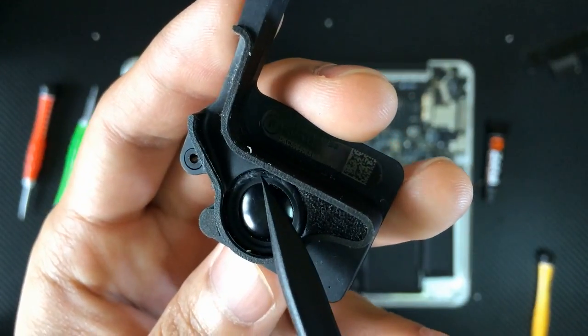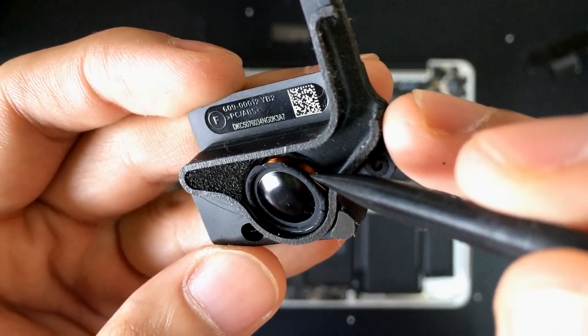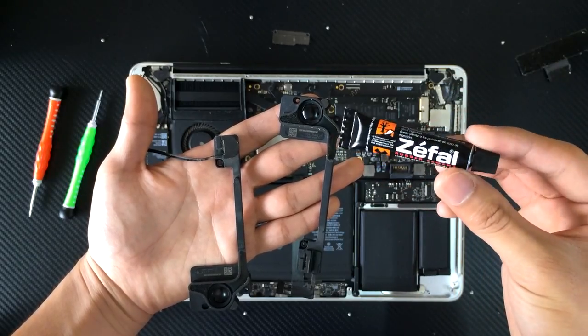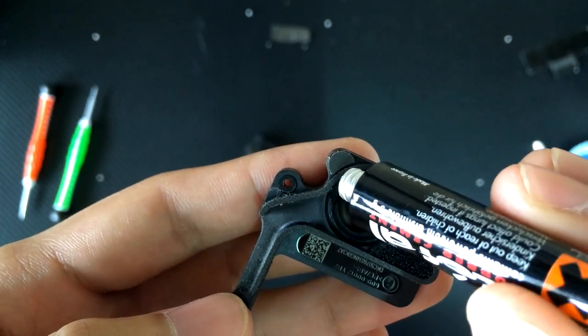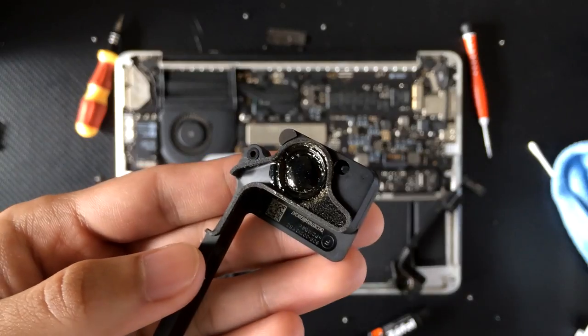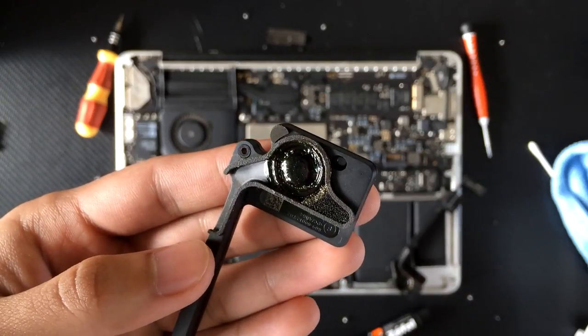The crackling sound is actually caused by a torn part of the speaker driver assembly called the surround. In order to patch it up, you must use an adhesive that bonds rubber and dries up to a flexible finish so that the driver can actually still vibrate and flex and therefore still produce fair sound.